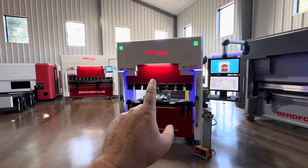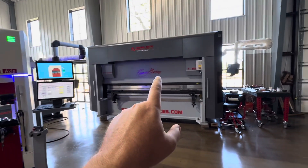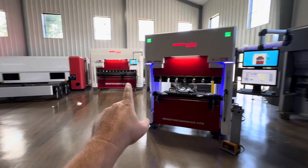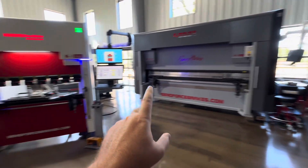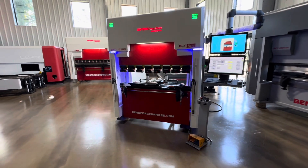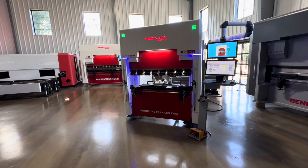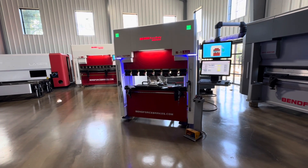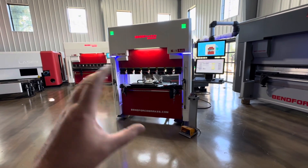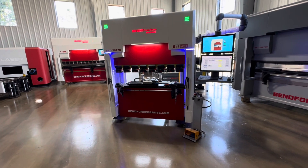So 5-foot 70-ton, 8-foot 145-ton, 10-foot 220-ton. That one right there will bend quarter-inch at its full width, and so will this one. This one will bend quarter-inch easily all day long, but probably at about three or four feet it's kind of maxing it out — unless you want to go with a different, bigger die, then you can get quarter-inch at full width on this one too. These all come with a two-inch die as their largest die, which is set for the optimum setup for quarter-inch.